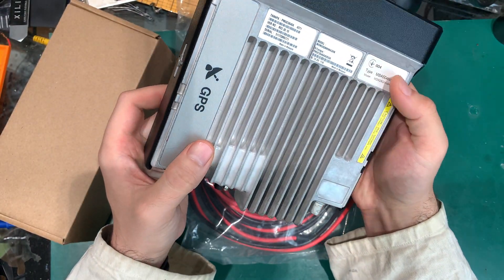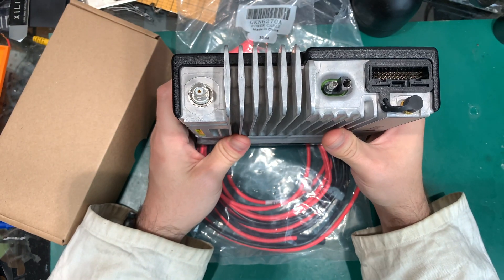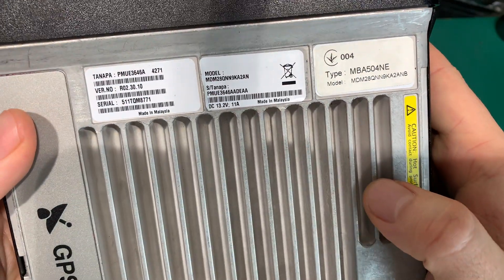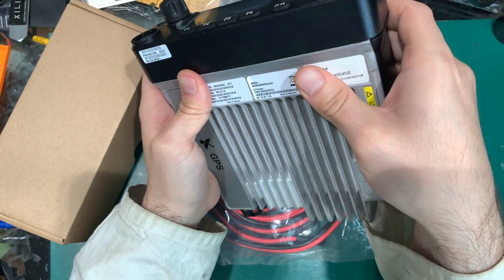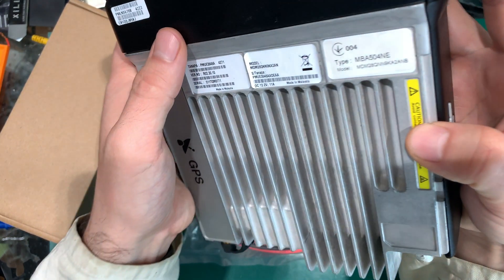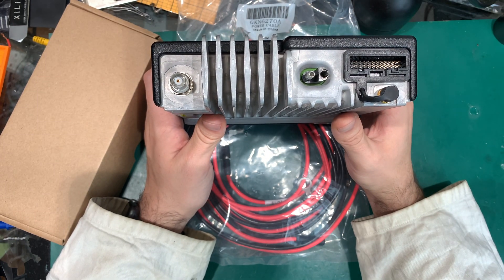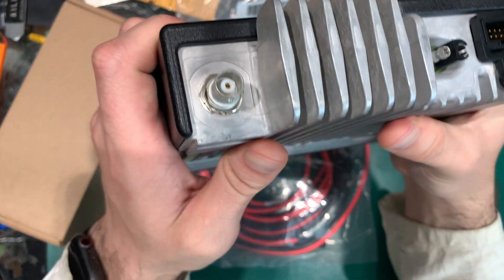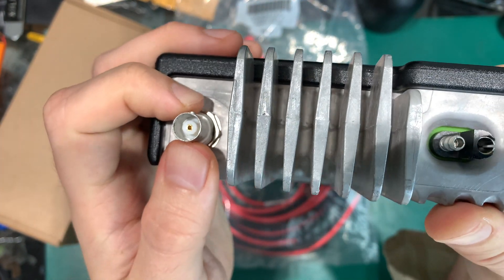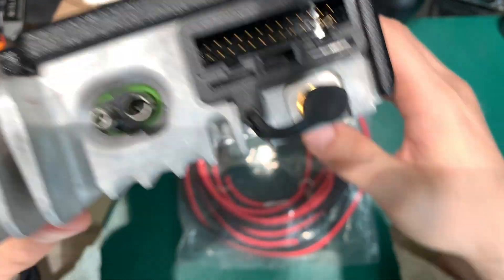On this side we've got a screw for mounting and tilting. The bottom part is just one big heatsink and it is really massive. That's quite interesting because the current rating is 11 amps — 11 amps for a 25-watt radio at 13 volts looks like a little overkill to me, that's over 100 watts of input power, which seems quite weird. We've also got the external antenna connector, a very nice type-N connector.